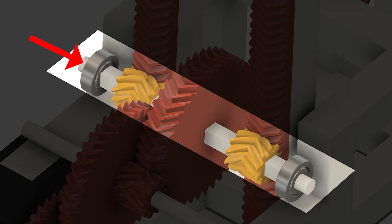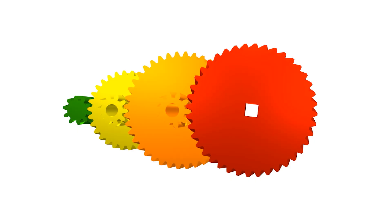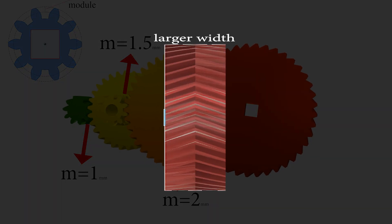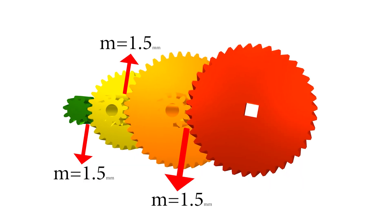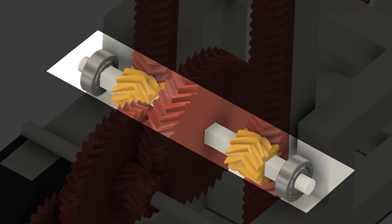The high torque at the final stage could break the gears, but that's not necessarily a problem because larger gear modules and greater gear width are chosen as torque increases. I chose a 1.5mm gear module for all gears against this high torque. With this module, the tangential force of the pinion gear and the total press capacity are calculated. In this case, I should have chosen larger modules in the final stage, like 2 or 2.5mm.